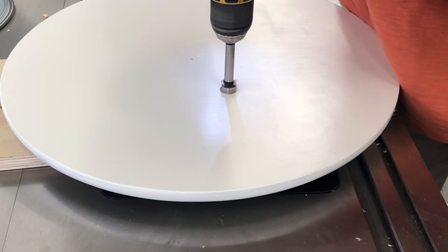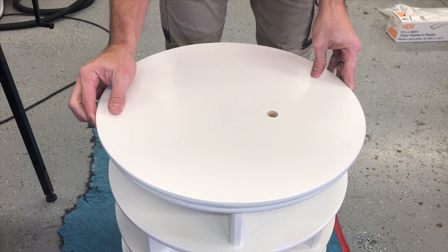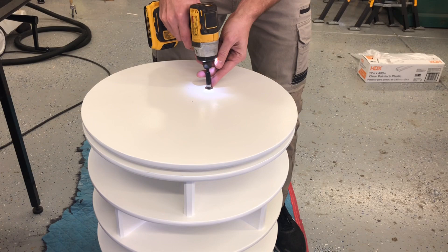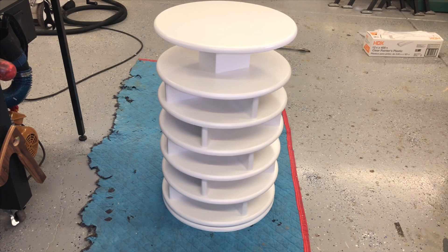I'm just cutting through the other side so I don't blow it out. I'm lining up those holes and screwing them down with some button-head screws, nice and snug. When you look through there, you can see the holes you want to screw in to attach it to the main base — just keep spinning it around until you line up the holes to mount to the main body. The main test, of course, is to see if it revolves without looking like a caveman wheelbarrow, and it spins pretty nice. All in all, pretty happy with that.